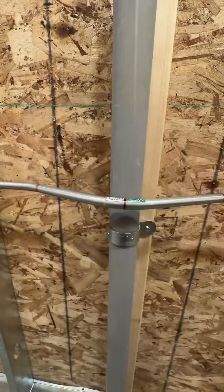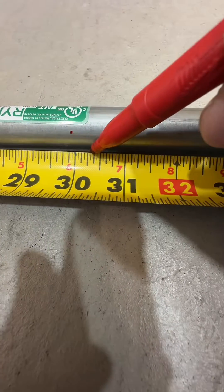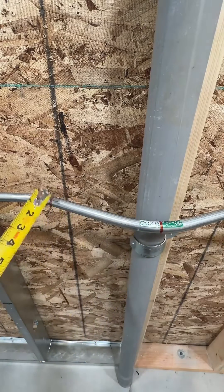Center, according to the instructions, is 30 inches. Our shrinkage per inch is going to be 3/16ths. So for that center bend at 45 degrees, we've got to go 30 plus 3/16ths times 3, which is 9/16ths. So the first mark is at 30 and 9/16ths.